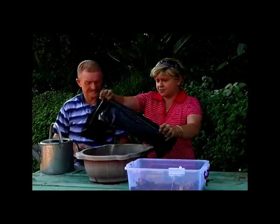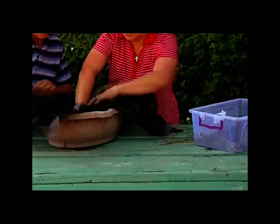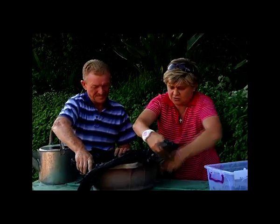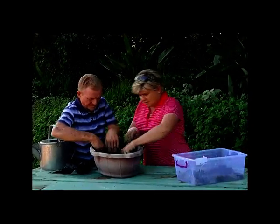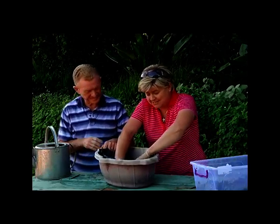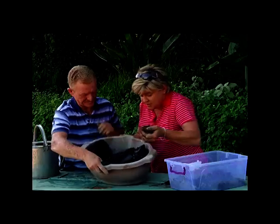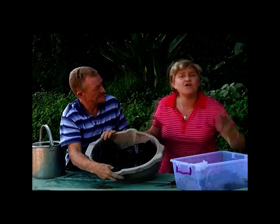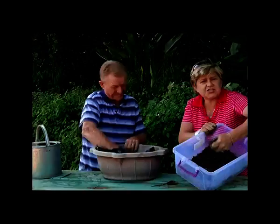This is where our black plastic comes in. Just pop it in there and trim off the edges to look neater. The plastic is basically a releasing agent — instead of putting something in the mould, you use the black plastic and it works perfectly. Take a good lump of the mixture and start at the base in the middle, bang it in at the bottom. Make sure it's at least two centimetres thick — anything thicker is overkill, anything thinner and you're teetering on the edge of it snapping. Two centimetres is about where you want to go.